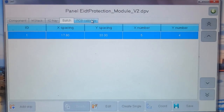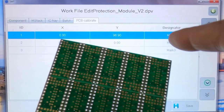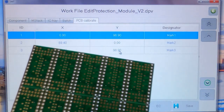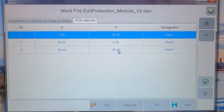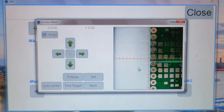I recommend that you check that the calibration is correct. Mount the board into the machine and check the calibration to make sure that what you've set is correct. You will need to enter these values yourself because the fiducials are slightly different on a panelized board. If you've got boards with a surround, quite often the fiducials will be on the surround itself rather than on the individual boards. Either way, it makes no difference — as long as you know where they are in relation to the components on the board, just make sure you enter appropriate values.